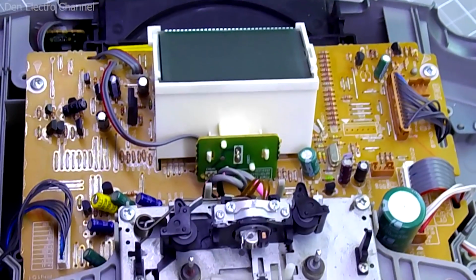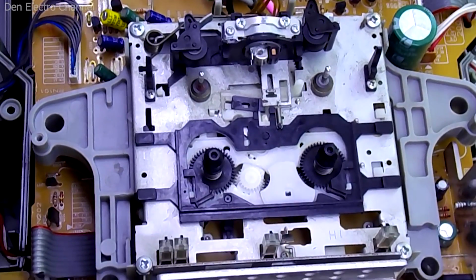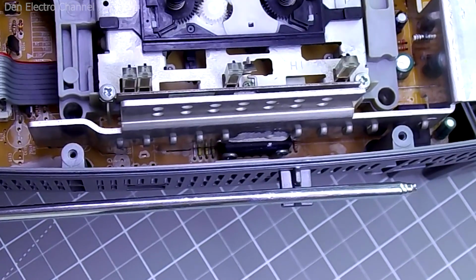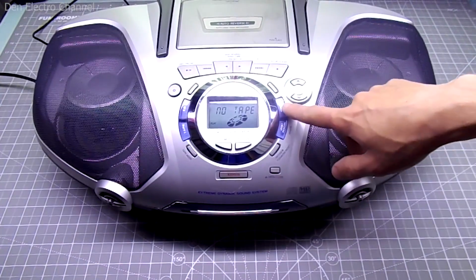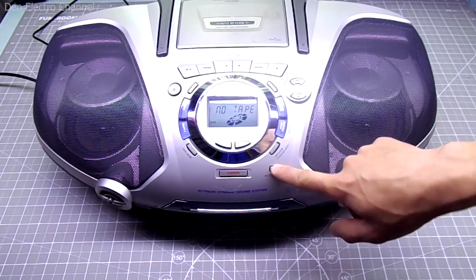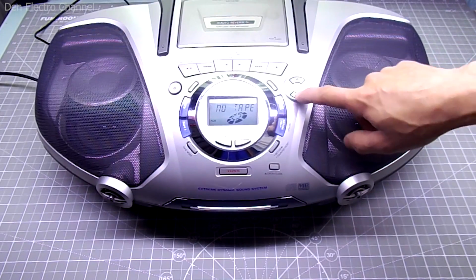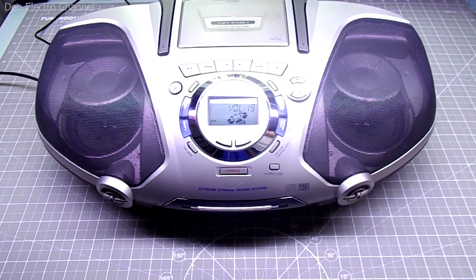To make an audio input on a speaker system that does not have one, you can always find an amplifier chip, find information on it and send an audio signal to its input. This will create a simple audio amplifier. But in this case, the boombox will not work correctly, and when switching operating modes of the cassette, discs and radio, the sound will constantly come from the audio input. In addition, the volume and bass boost buttons will stop working.